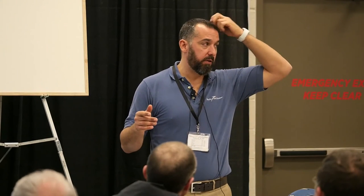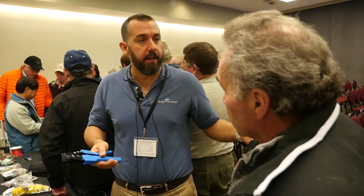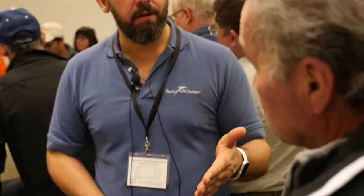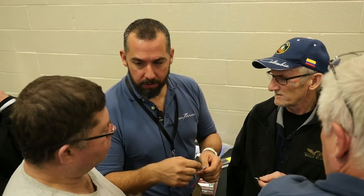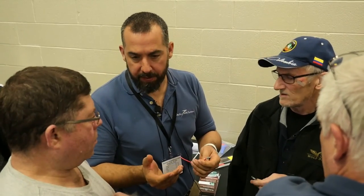As a do-it-yourselfer, the problem is your limit of experience — how many crimps are you going to do in a year? A ratcheting crimper helps offset that lack of experience. Romeo can do crimps in his sleep, but for everyone else, the ratcheting crimper always brings you the right result. What's interesting is that there's no room for error — it's the one you get wrong that is one too many. And putting heat shrink on the side of an open-ended lug is of no benefit. On larger lugs with all the wires open, you might think moisture won't get in — but as the wire heats and cools during use, moisture gets wicked in and out.